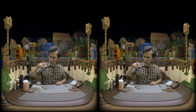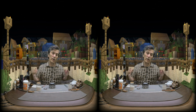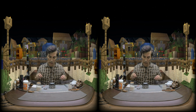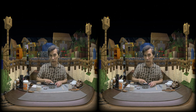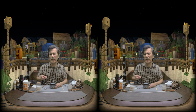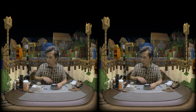Now, when you're using graphite, graphite's conductive, but it has a high resistance, which means if you try to send current through it, it's going to slow down and it's going to resist that current. Ideally, in an electroforming process, we want the least amount of resistance so we can coat the part in copper as fast as we can. This is a good compromise for copper paint, graphite paint, and especially nickel paint. Nickel is extremely toxic, and you should have a specialized setup in order to do that.